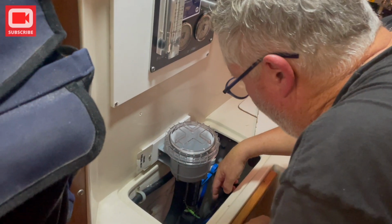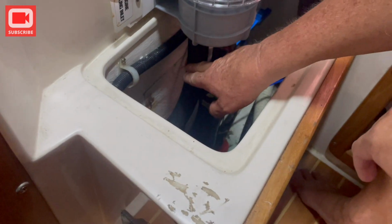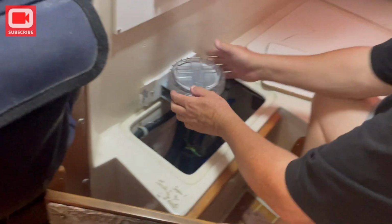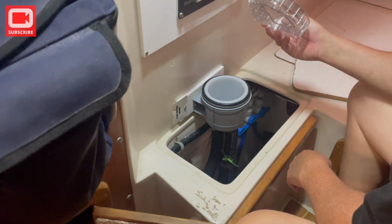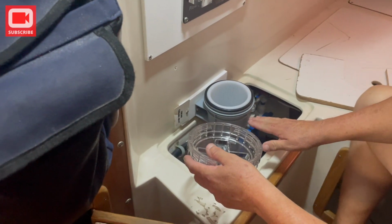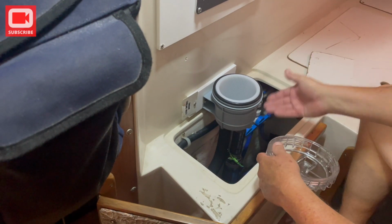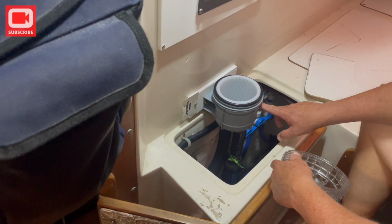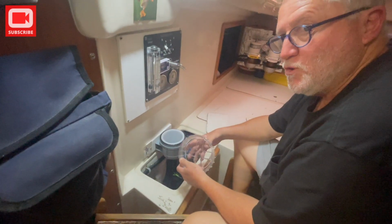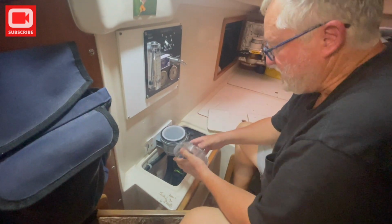Well, that strainer was down there very low and a pain. The hose that went over to the engine was just kinked, with a really tight bend. So I moved this up to where we could get to it easier. So it's not completely below the water line, right? Yeah, but when I opened the seacock, water just came up and went right down and leaked out of the raw water pump, so I shut it off. I think it's going to fill up about halfway at the water line, which is what everybody says. Everything I've read says that's where it should be. It is not below the water line, but not way above it either. So I think I got it just right.